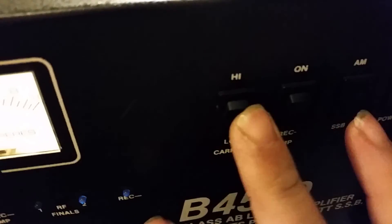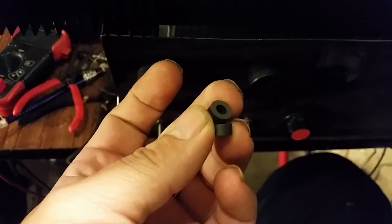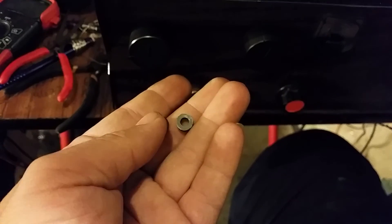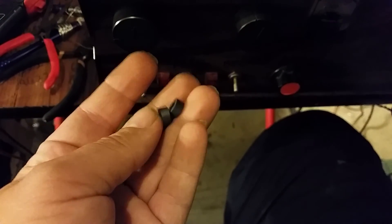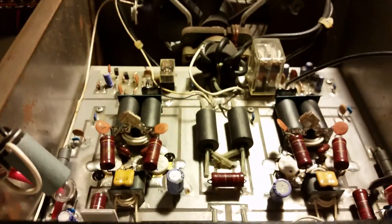One last thing — the low was not doing hardly anything at all. I have never seen anything like this, but for the low, all it did is have a wire going through two beads. It was giving a little less just by sending the wire through those two beads — I guess a little bit of the RF was being soaked up in those beads. So I went ahead and utilized a resistor — a big five watt resistor — plus a ceramic cap just to filter out any remnants of DC.